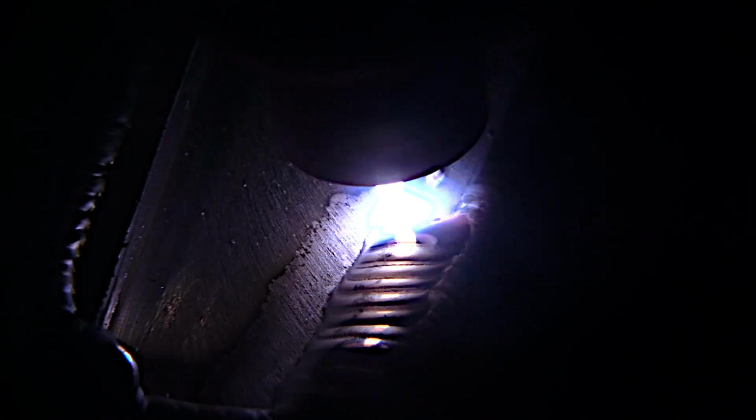But I'm still using the cleaning action here, baking those oxides away before I ever puddle it. That way it usually puddles a lot cleaner. I got a fairly clean puddle going here, and you can see it just cooking the crud away all around it.